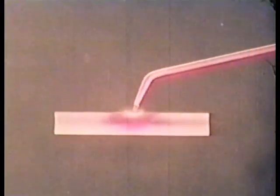Now, let's go back to our original bar and see what happens when we heat only one side. Getting up close, we see the expansion in this case is localized and uneven. The surrounding cool metal acts similar to the vise and restrains expansion in these directions, but there is no resistance to expansion in this direction. It is obvious that this uneven expansion causes an unnatural displacement of metal. When this area starts to cool and contract, a small amount of that displacement becomes permanent. In other words, there was no control, and the final result is distortion.